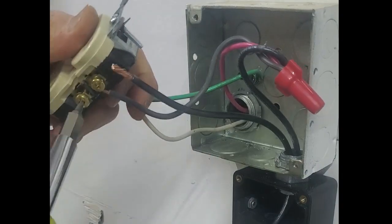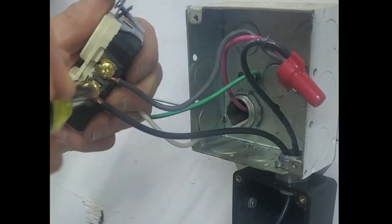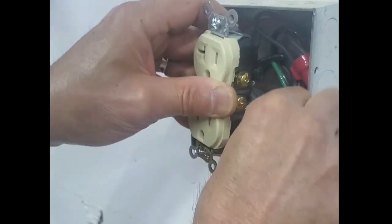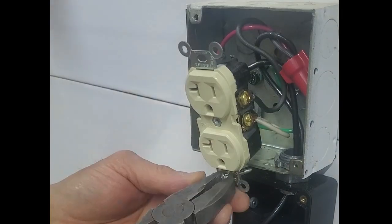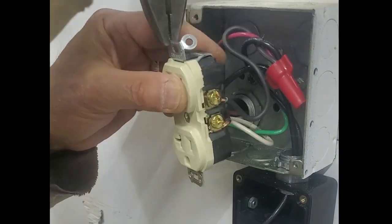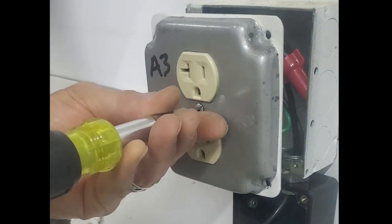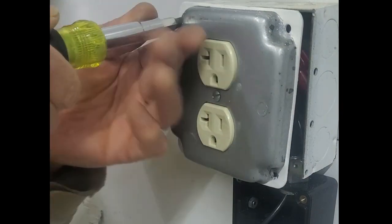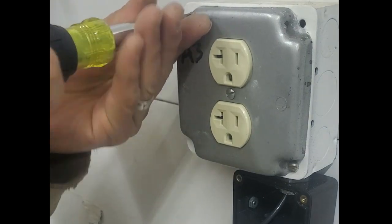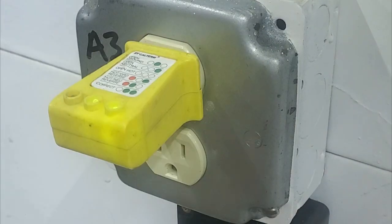Here I'm wiring the hot pigtail that does not pass through the current sensor to the upper outlet, and the one that does go through the sensor and triggers the blast gate to the lower outlet. I could have done this project without opening up the electrical outlet box at all by using a larger electrical enclosure with a built-in outlet, current sensing switch, and wiring space — plus a cord with a plug to plug into the existing wall outlet. But the cost of an appropriate enclosure, outlet, and plug could easily double my materials cost.